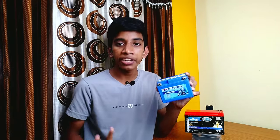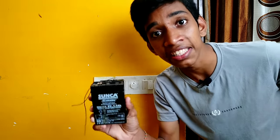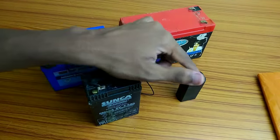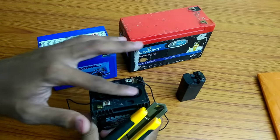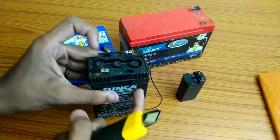This battery is perfectly suitable for my project. Now, I'm telling you how to change this battery and how to change this adapter. If you want to change this battery, it's very simple — but be careful. You have a cap on the battery. You need to put three holes in this cap to pour the acid in. The whole battery is a lead-acid battery. We fill distilled water into each cell, filling each cell to about 60–70%.